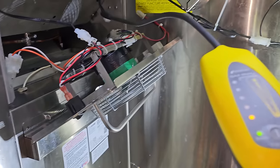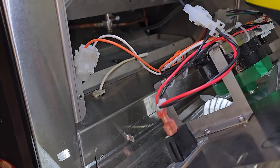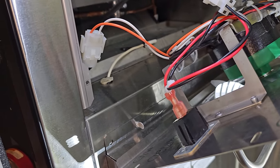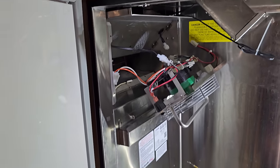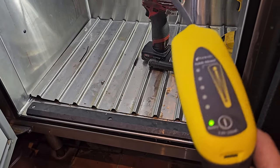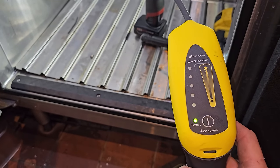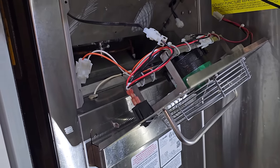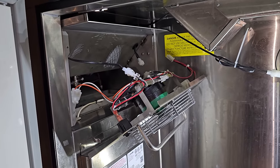All right. Still kind of zeroing out. Let's go in here. Have a look around this TXV again. Nothing. Yeah, this thing is very sensitive. If you shake it, now it's not going to do it for me, but I don't know. This thing isn't my favorite leak detector. I typically always verify with the bubbles with this one, but I'd really like to get my hands on the sensor for the Stratus, the hydrocarbon sensor for the Stratus. But all right, we're going to put this together and then watch it come down to temp.